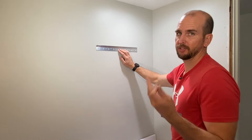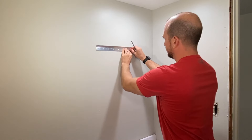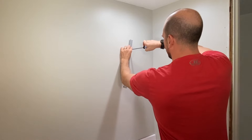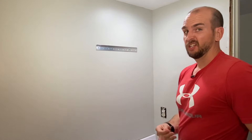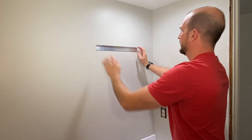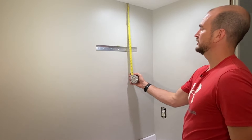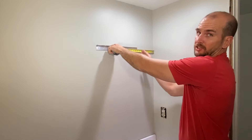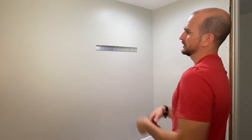If you have a drill or compact nut driver you can use that to sink the screw — I'm just going to do it by hand with a phillips screwdriver. It's okay if the rail loses its spot while you sink this screw because we're going to level everything out later. Secure that screw down quite a bit so it holds the bracket and when you level it, it'll stay in place. Now I'll double-check my measurements — it's best to fix things now than redo it later. I have 15 inches of clearance to the top and at least eight to nine inches on my left-to-right horizontal, so I'm good to go. Now I'll mark my two other slots to sink drywall anchors.